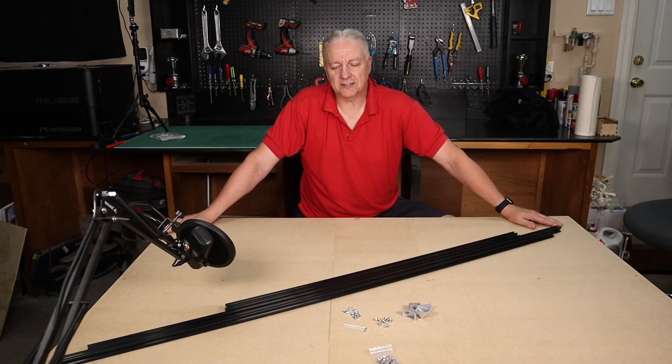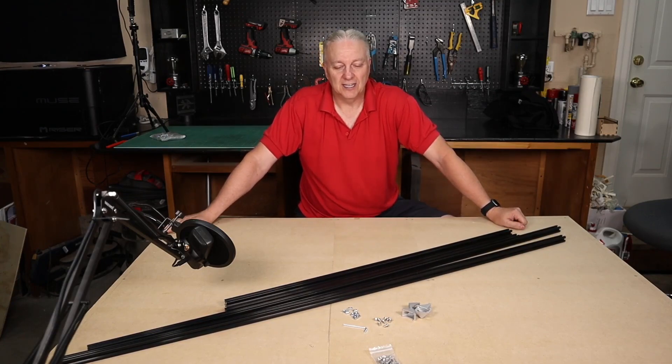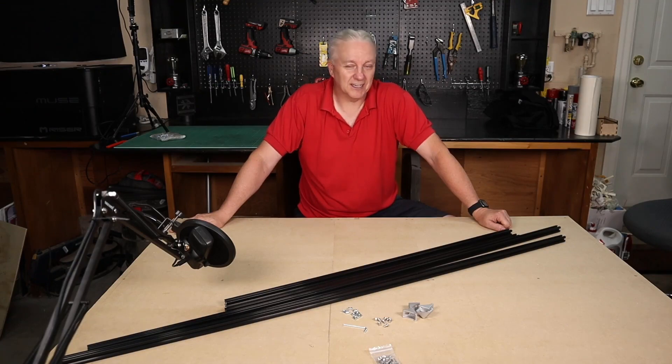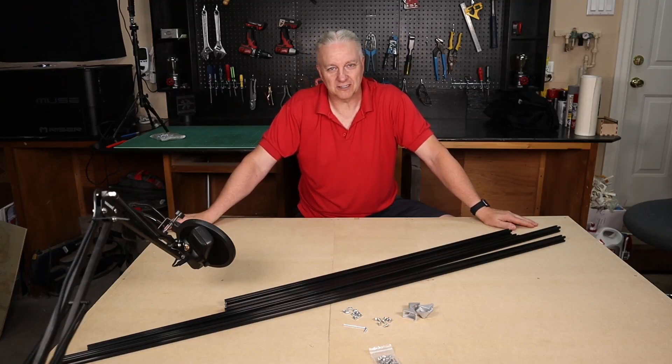I wanted to make this bigger laser. You'll start to see some aluminum extrusion here — aluminium if you're one of our UK viewers — and some hardware I'm starting to lay down. Parts are starting to arrive, and I'll walk you through building the frame and the design rationale I chose. The goal ultimately is to use 100% off-the-shelf parts, so you don't have to laser cut most things. The outside skin of this laser will be acrylic, which you could also cut with a saw and drill. So you don't specifically need custom tools, which lowers the bar for most people who are mechanically inclined.